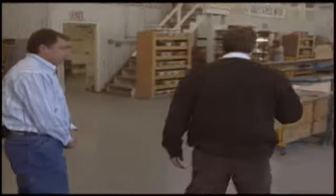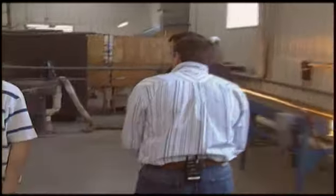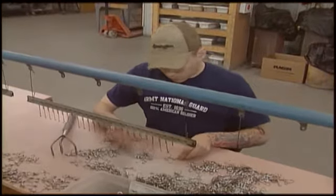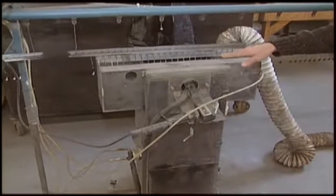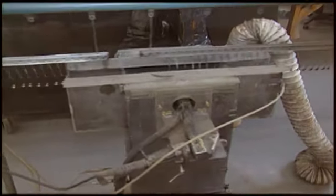For many of these, the next step is painting — the majority of them. We have a nice machine that we've designed and built ourselves to paint little items. Here we're hanging some round head jigs. These are shipping to a company in Arkansas to go into some kits — we have about 80,000 of these to make for them. They're just hanging them on the hooks and they'll continue down the line. Here we're applying a powder paint to them — in this case, gloss black. You can see on the heads down here that it's done a pretty thorough job. There are probably 35 or 40 different powder paint colors.